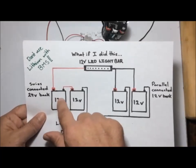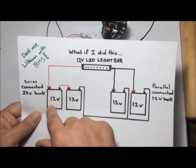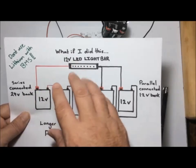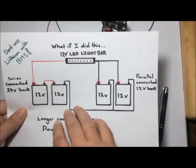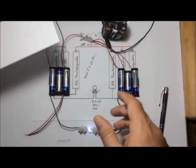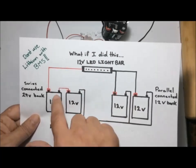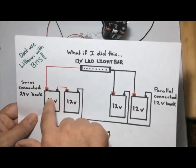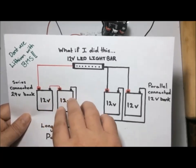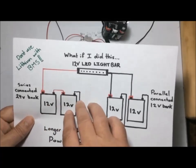You do have to be mindful of the battery's safe cutoff point. For a sealed lead acid battery, you don't want to drop it below 12 volts, because obviously that will do damage to the batteries. Be considerate of what type of battery you're using. If you're going to go that route, be mindful that these batteries may have a 0.8 amp-hour recharge rate, and you'll damage them if you charge them any faster than that.